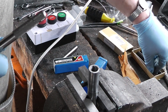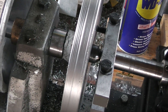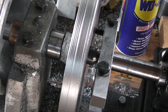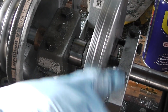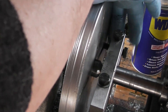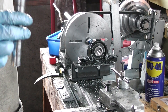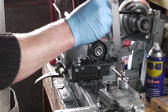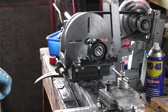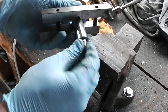Let's go to the finishing reamer. Here's how it's arranged: the hole in the end of the round stock is seated on the cone I turned, the lathe dog is clamped around the round stock, and the bolt going through it is being driven by the face plate. Side note: when you tap the crud out of these reamers, tap with the flared end down so you're tapping out of the flared end — otherwise it'll compact. I'd say that's done; I can't detect any end play and it seats right solidly.